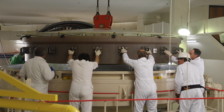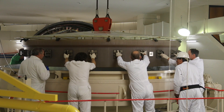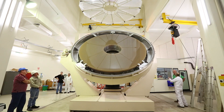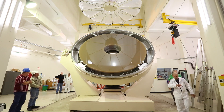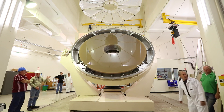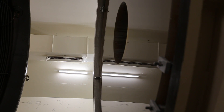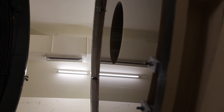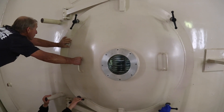There's a couple of hours involved in the cleaning, and a couple of hours involved in getting it picked up and put into the chamber. The very final stage before it is coated, once it's upright in the chamber lid, you then have to paint it with a little two-inch wide anti-static paint brush — you can see the dust just falling off, dripping off. Then as soon as you can, before more dust gets a chance to settle on there, you close it up and aluminise.